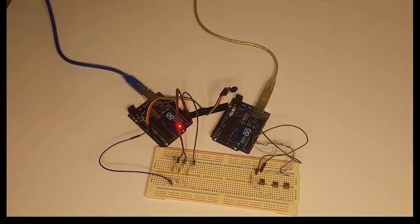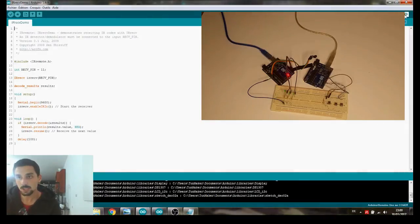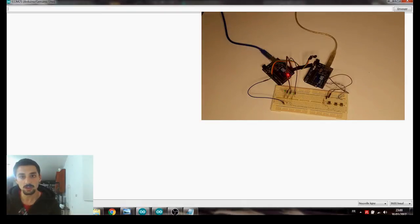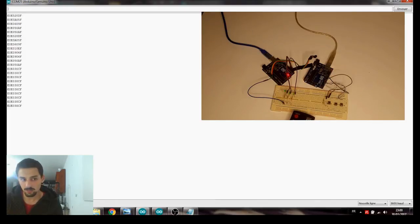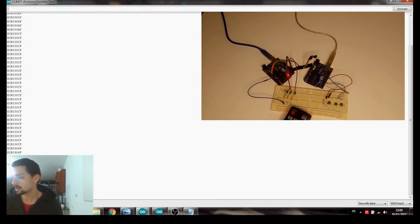It's uploading now. Upload complete. Let's open the serial monitor. Let's press a button. So you can see when I press, this is number 1, number 2, number 3, number 4, number 5, number 6. If I keep pressing, it keeps sending that signal. So one press, one code. Long press, it's going to keep receiving the code until I stop.